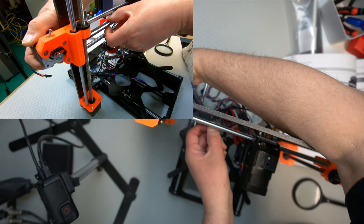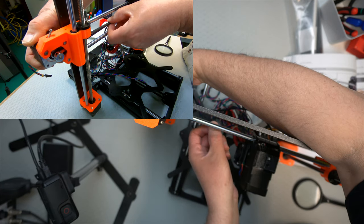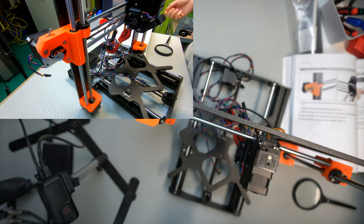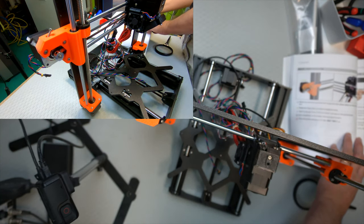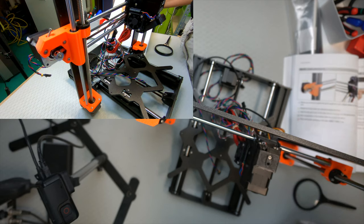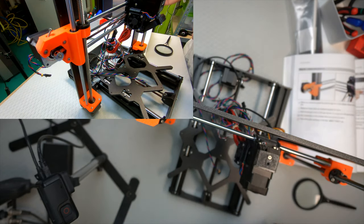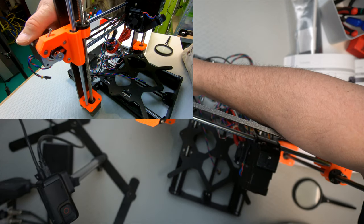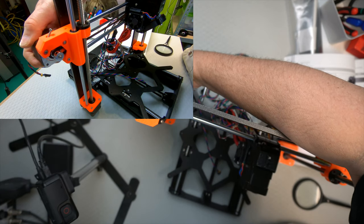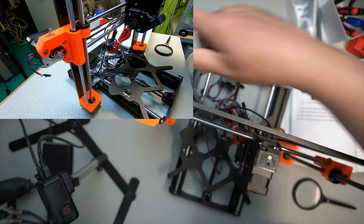And then one should check. It shouldn't be floppy on its own weight and feel reasonably tense. Let's see. If you are struggling to rotate the motor back into position, the belt tension is too high. Well, I don't say I was struggling. I mean, I can just click it into place, so I suppose one could say that.